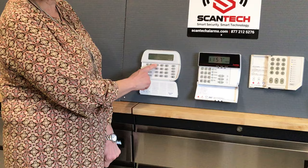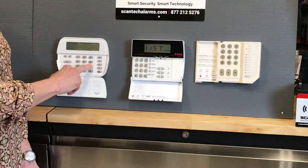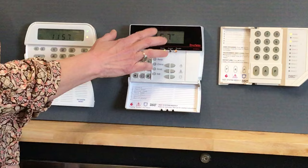If you get a 1, you would press 1 again and it tells you that it's still at 1. That's telling you that it's a low battery in your main control panel. To clear the trouble menu, you would hit the pound key twice and then it clears and gets you out of the trouble menu, but your trouble is not cleared until you replace your battery.